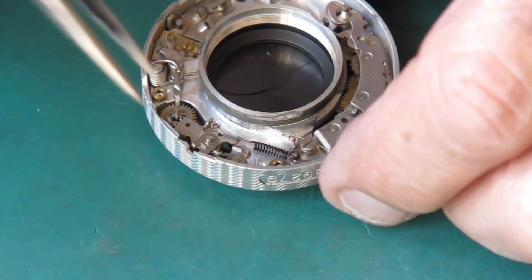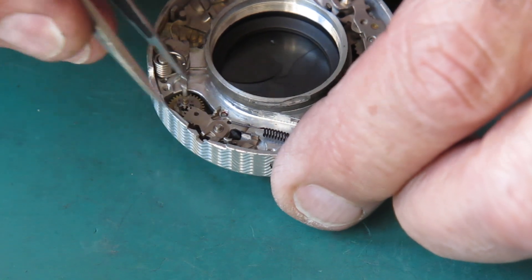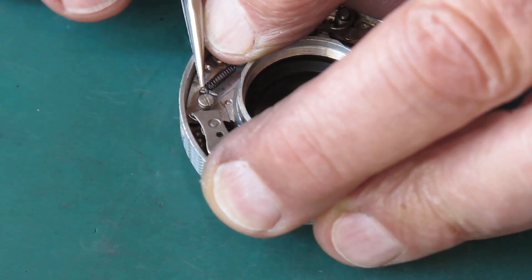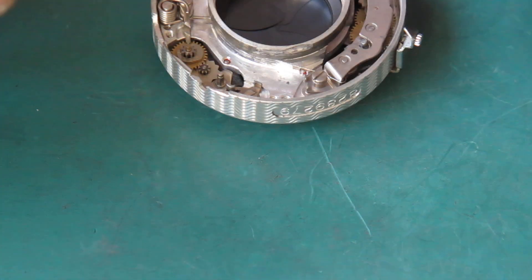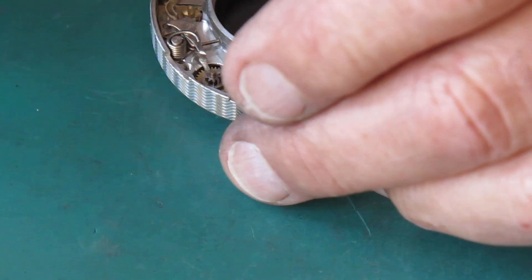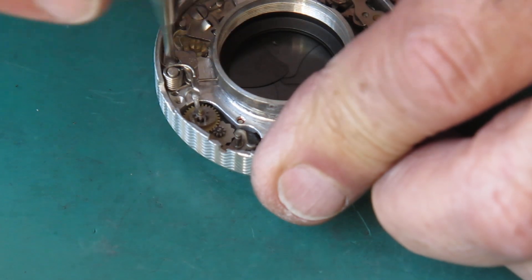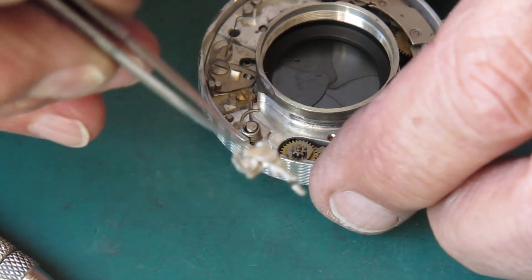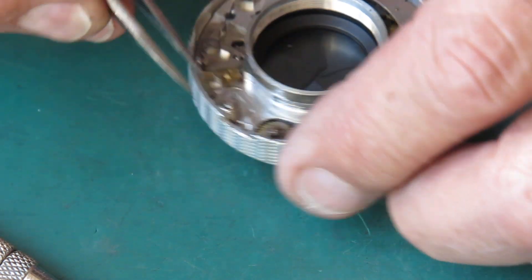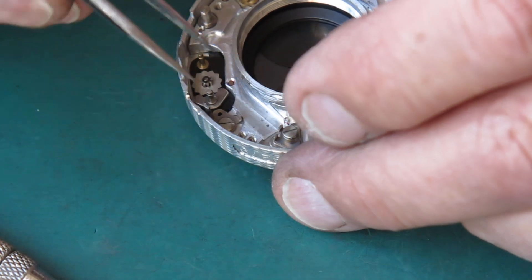Take that cover off. We've got two little brass standoffs there. I've got to unhook this spring for the flash sync mechanism. Take this off — this is two pieces, this arm, that come apart. They're only held together with a fine spring. Don't be surprised if that comes apart on you — it's not the end of the world. Just remove this screw, which allows me to get out the moving flash contact and its little control arm. You can lift out the 500th of a second spring, lift out this cam from the flash sync settings, and lift out the pallets.